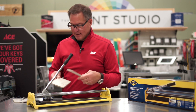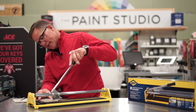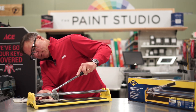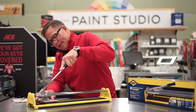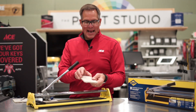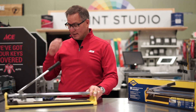Look at that — a nice, clean cut. And if you wanted to cut another tile another way, you bring that wheel down on the end, put a nice amount of pressure, and you can kind of hear that cutting come across, and then the cut. That's how it works. It's a very simple tool and you can cut a lot of tile.